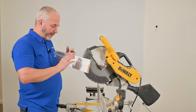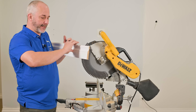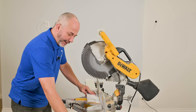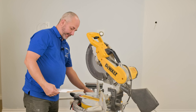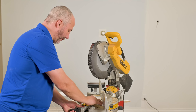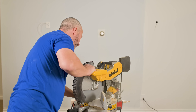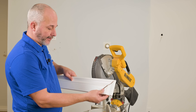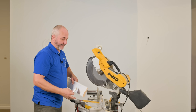If you're working in an area where the baseboard comes to an end — like at a staircase — and you want the detail to return back down to the ground, cut the baseboard flat at 45 degrees for a miter joint, then go to the other 45 on the remaining piece. Now you have a baseboard that can finish to the floor, which is a much nicer look than just painting it in.